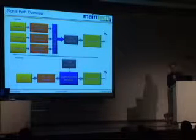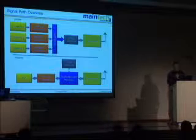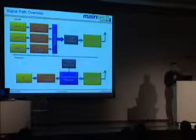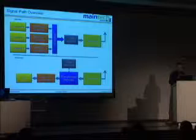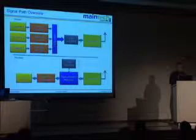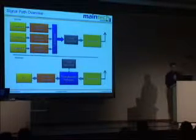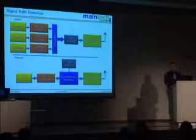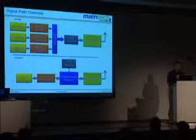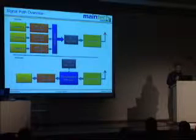Receivers are cheap, and it doesn't make any sense to build them. Well, it makes sense, obviously, but not for us, since chips are really cheap, made by Chinese companies, so no need to hack them here. The first step here is the demodulator, then the demultiplexer, and the demultiplexer also feeds the program service information table interpreter, which helps finding the programs. And the final step is the MPEG-2 video decoder, which does the decoding of the video and audio signals in the stream, and then the TV set which the watcher uses to convert back to analog signal.